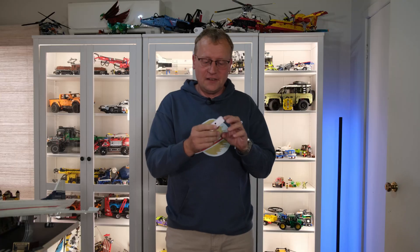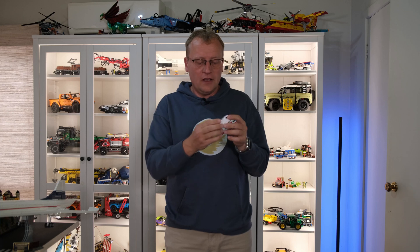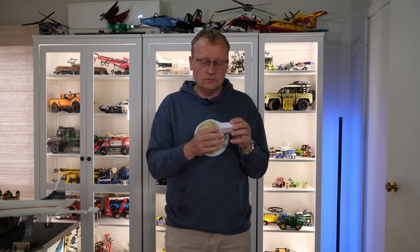The old lights are off. Let me introduce you to the A1 SLWF-03 LED controller — that's what it's called. SM Lite has product names like that, just get used to it. This is a tiny controller, powered at 5 to 24 volt. You plug in the ground, the signal, and the power for the WLED strip, and you're good to go. It connects via Wi-Fi to Home Assistant.